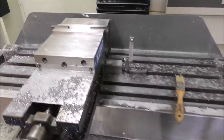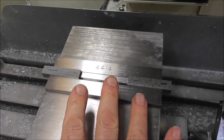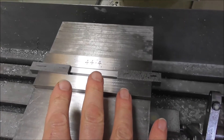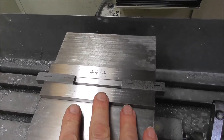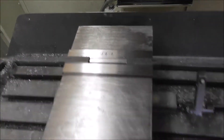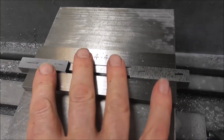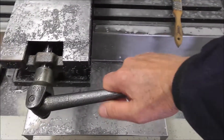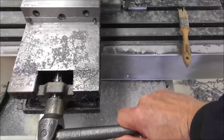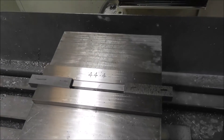If you think about how the jaw is clamping on your part, you don't need to do it up excessively tight - you're only going to buckle the vice, strain the screw, and damage the part. I see people hammering their handle; you don't need to do that. If it's an accurate vice closing in a balanced way with two parts or one part in the middle, you only need a little bit of torque with one hand - you're never going to shift it.